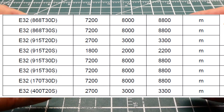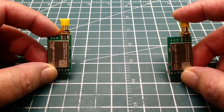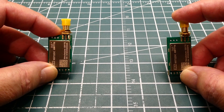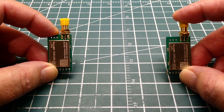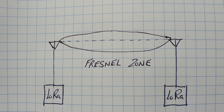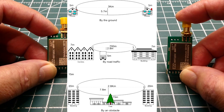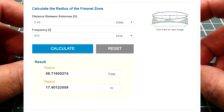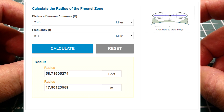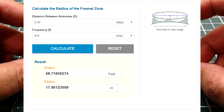If you look at the spec sheet of these LoRa radios for the range, they could be as high as 8 kilometers — now that's under ideal conditions, so you probably won't see that. You have to have visual line of sight between the two antennas and radio line of sight. Radio line of sight is the area around the visual line of sight that's clear of obstructions, and it's called a Fresnel zone, shaped like a football. You can find a Fresnel zone calculator online to calculate the amount of space you need around your visual line of sight that's free of obstructions.